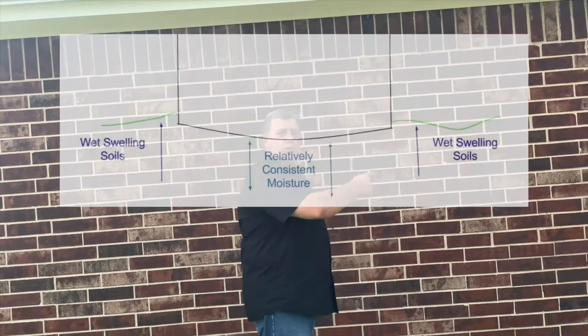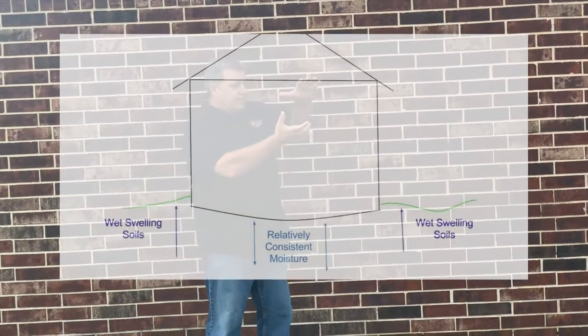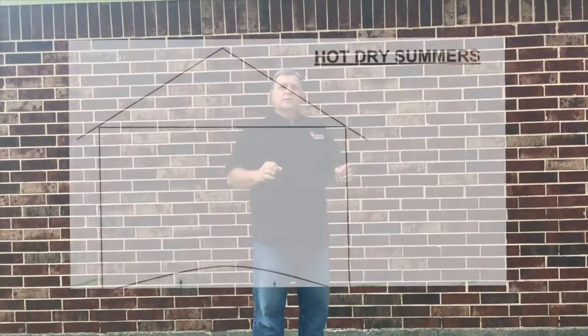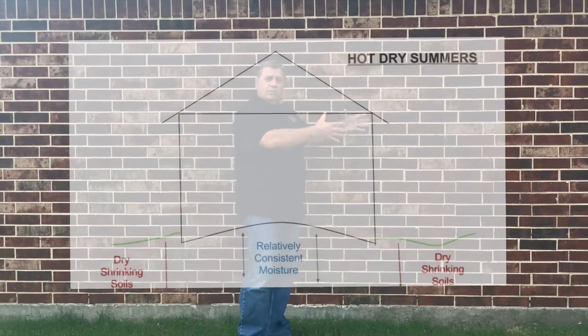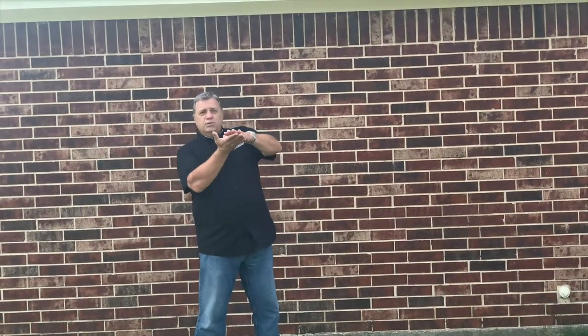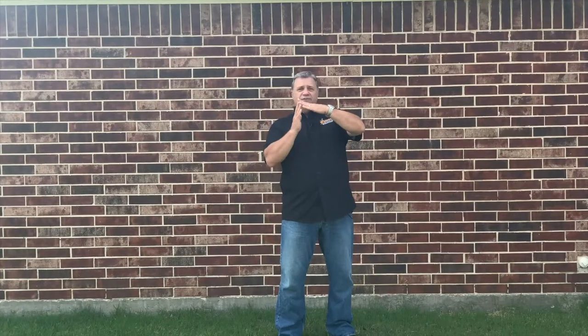When it's raining heavily and the surface soil is getting very wet, the soil six to ten feet under the foundation is not. During the rainy season, the surface soil swells and pushes on the edge of the house, but the soil ten feet in isn't really changing. In the hot dry summer, the perimeter soil dries out tremendously and shrinks — actually pulling away from the bottom of the foundation. Year after year, this pushing and dropping away flexes and gradually weakens the foundation, creating foundation settlement.